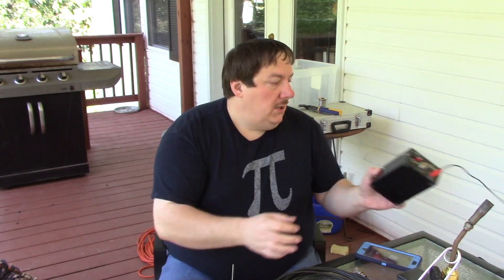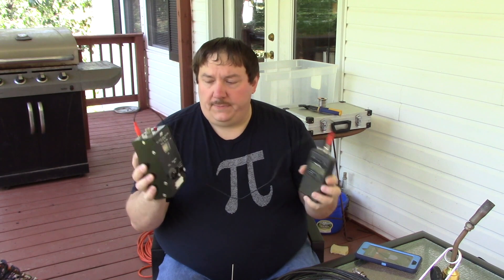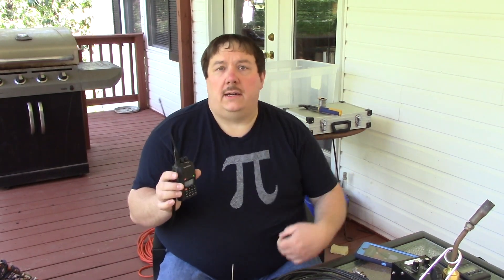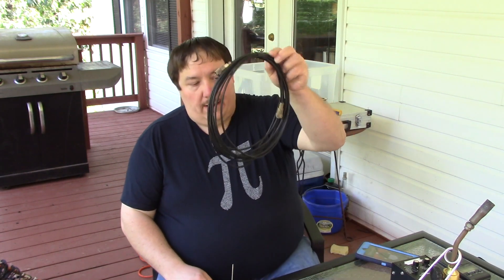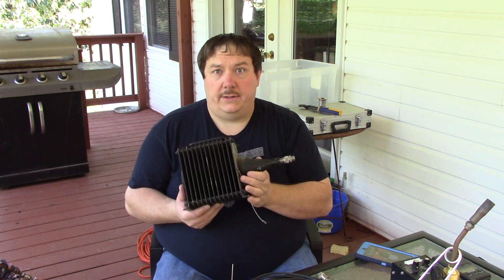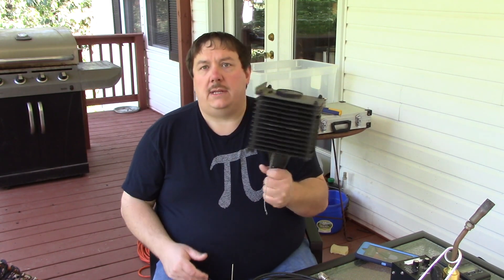A few things you're going to need. You should have an SWR Tester or SWR Bridge Tester. Mine is an older one but it still functions just fine. You will need a radio to test with as well — for this you need to be a licensed ham radio operator. You will also need a dummy load, which is an antenna simulator. It doesn't allow transmission outside of its short area, but it simulates the perfect antenna for testing all the rest of the equipment.